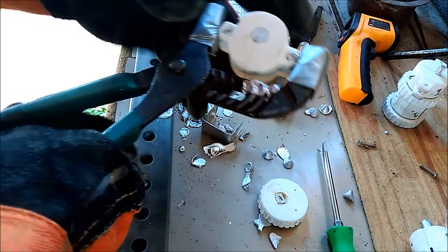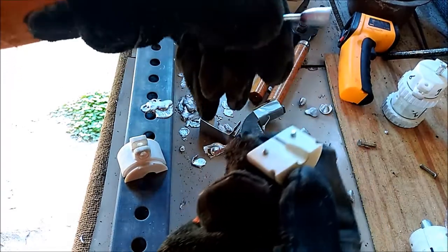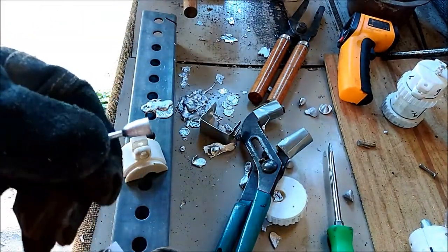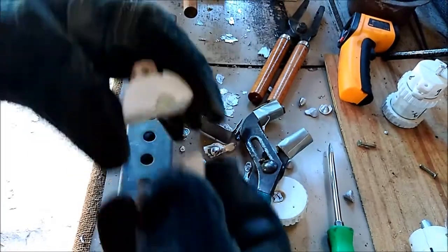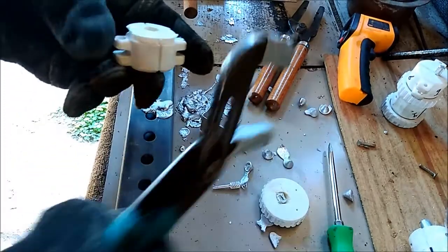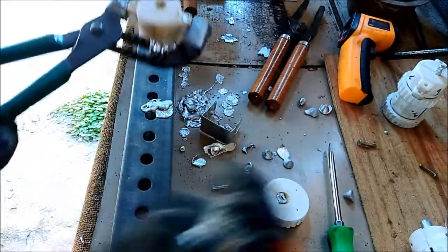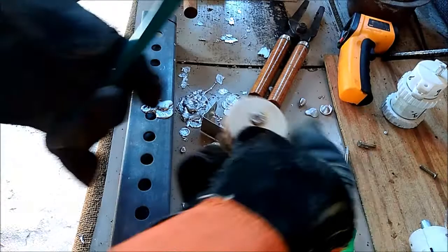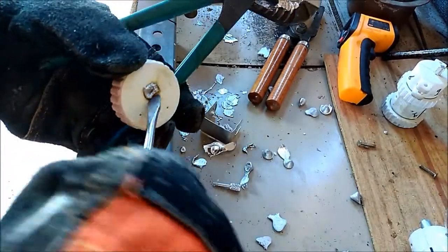These gloves make it impossible to work proficiently. That was actually a good base — that's another good bullet. I'll try to do ten of them in a row, then we'll take a look at how the mold has been affected. It seems that starting out with the molds preheated sure enhances the possibility of getting good bullets right off the bat — or better bullets, I should say.